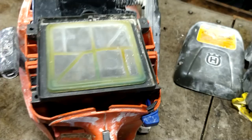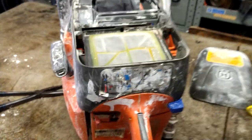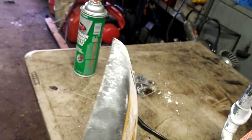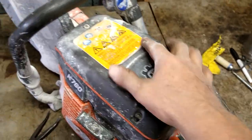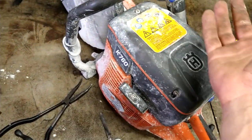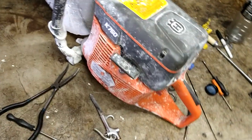Just got to maintain your equipment once in a while. Get this all blown off and cleaned up, then get the other one all blown off and cleaned up, put it in place, tighten down these four bolts. Go back through your chokes and your throttles, make sure everything is working properly still. Then put the air filter assembly back on, tighten this bolt and this bolt, do the top off and get all the dust out. You don't have to have it perfectly clean — I find it's best to leave it nice and dry. Any wet type stuff will make the dust stick, and we don't want the dust sticking to a concrete saw — that's what wears them out.